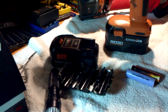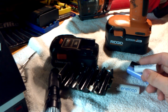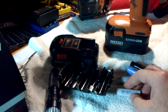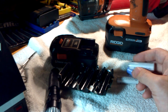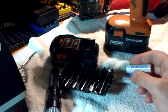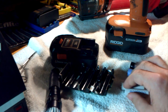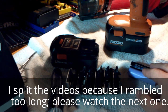You can also get nickel metal hydride cells — these are double-A's from Eneloop, very common, you can buy them on Amazon. These are rechargeable nickel metal hydride cells. One of the main problems with nickel metal hydride is they lose their charge fairly quickly just sitting there. But Eneloop, which is made by Panasonic, has figured out how to stop that from happening — at least so quickly. It's gone from something like 15 to 20% per month down to 1 or 2%, I believe. So these hold onto their charge for a long time — probably equivalent to lithium ion cells. You can charge a battery pack and it'll stay charged for years before you need to charge it again.